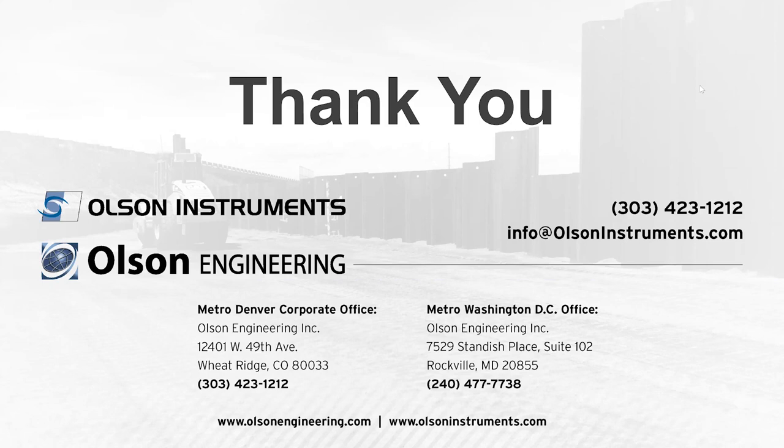What are the advantages and disadvantages of the different LWD models? We have a biased opinion, but the reasons we like ours: number one, we measure the force — we think that's important. Two, we use a geophone to minimize integrations to a single integration. Three, we use a steel spring — it's less temperature dependent, provides more consistent force, and doesn't age over time. Four, our unit is made of stainless steel, not just plated — it's all stainless and aluminum, very durable. Five, our spring is embedded in the weight, creating a cleaner impulse loading on the plate. Also, it's made here in the US. Multiple researchers at Colorado School of Mines and the University of Maryland all confirm you're better off measuring the force for more accurate results than assuming force from drop height and weight.